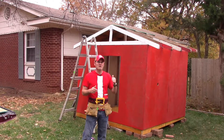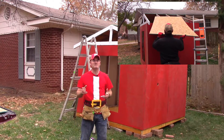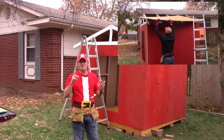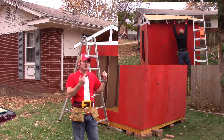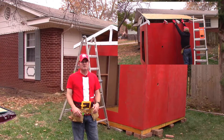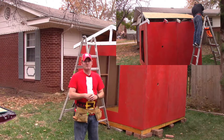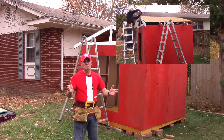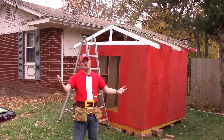Now it's time to put the roof on. The thing to remember when you're building this is you're not building a shed that's going to last 30 years — you're building a six-week structure. You need to protect it from rain; it's not going to fall over, just needs to meet your needs. I build the base of the floor with nails as you're supposed to, but everything else is kept with screws so I can instantly bring it up, take it apart, and store it. It's only designed to last six weeks every year.